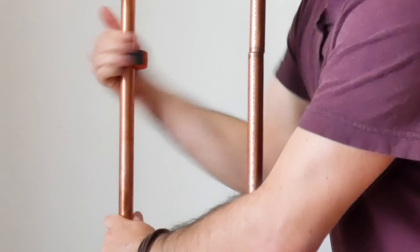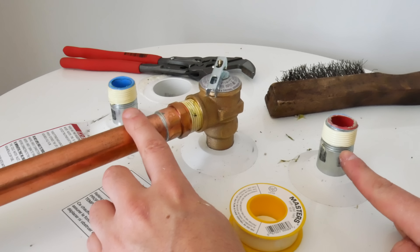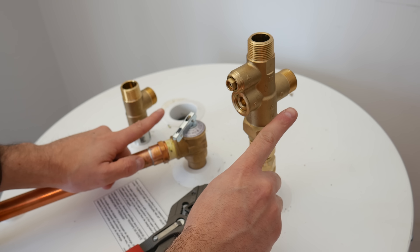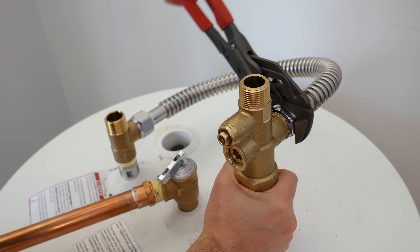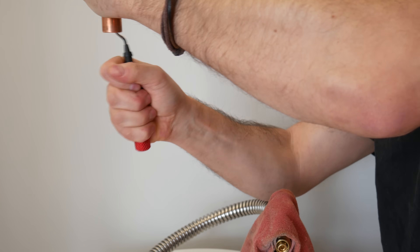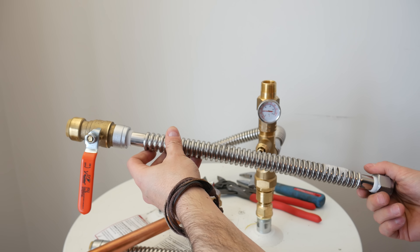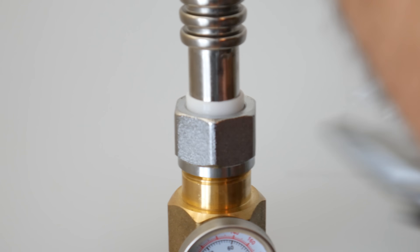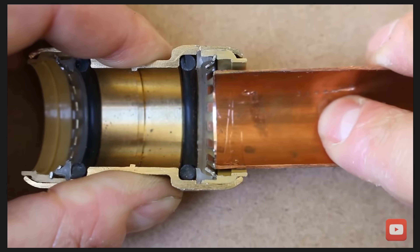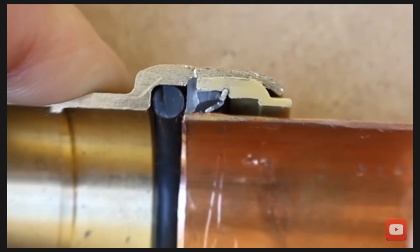First off, once you're sure there's no more pressure in the lines, cut both the hot and cold, remove these and keep these as you'll be needing them later during the install. Apply some PTFE or Teflon tape around the inlet and outlet and screw both the valve and T until they're nice and snug, pointing both connections towards the back of the tank. Don't forget to install the hose that goes from the cold line to the mixing valve and make sure both strainers are in place. Then go ahead and deburr both pipes, take your measurements, cut to length, and solder everything up. If you chose to use push-fit fittings, there are these neat flexible hoses that are really easy to install — you just screw this part on and push the other end onto the existing pipe. Make absolutely sure to watch the complete guide on push-fit fittings, as if they're not installed properly, they'll leak.